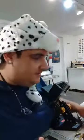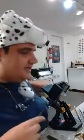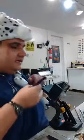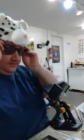Here's a quick rundown of the tools I'll be using specifically for this job. I've got a 14 millimeter female ground joint forming tool here. I think Griffin Glass makes this; I got it from Mountain Glass. The tube I'll be making will be in cobalt blue, 35 millimeter. To make our joint, I have some 16 millimeter, I believe. And I've got another ground joint to finalize it. This has a bunch of beeswax on it, sitting in a pickle jar lid, all scungy and nasty, but it works. I've got reamers and various other glassblowing tools.